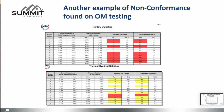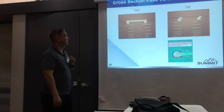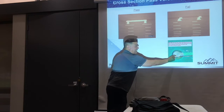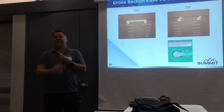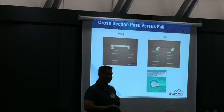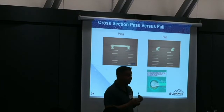Here are the failures — the coupons read red, and then there was temperature cycling. Another embarrassing example: this was a really large panel, 24x36, and they misregistered the panel. The coupons that passed had good target and capture pad alignment for the vias. The ones that failed had misregistration — only half of the laser via was inside the pad, 180 degrees out, half the connection. During temperature cycling, resistance went up. Every time I found a failure in D coupon OL testing and cross-sectioned it, it was a non-conforming condition per IPC-6012, 6018, or 6013 — low copper, void, or crack. They matched. There is a direct match correlation, which validates it's a fair test.